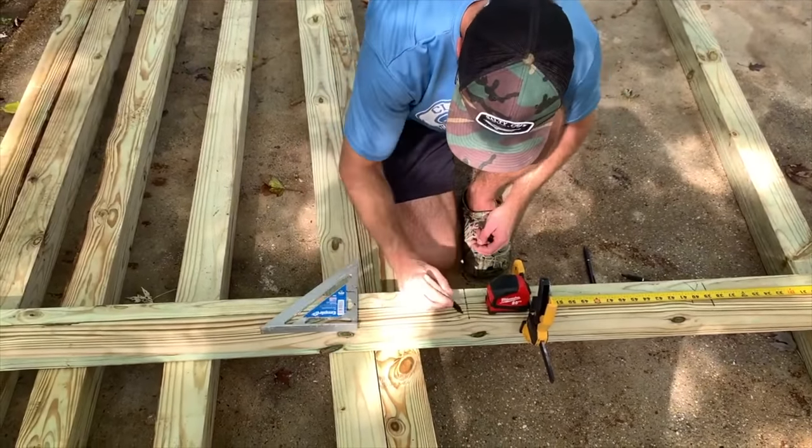When you're tightening the screws, you want to make sure that you don't over-tighten and warp the flange, just tighten it enough so it holds the window in place. And as you can see now, I tried to clean up any excess caulk, but because it was black, it just made a mess. I recommend that you use clear sealant for your window installation. I made sure to wipe off any excess that would be visible on the window.